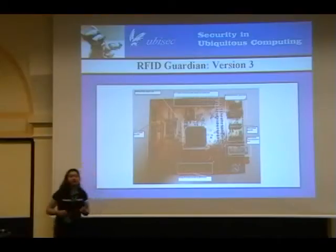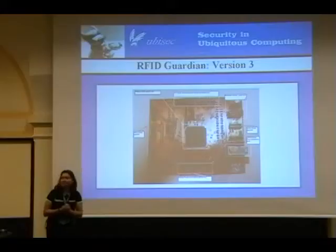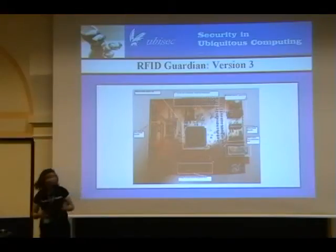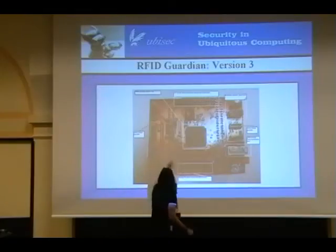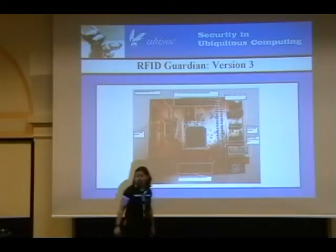There's also a lot of RFID at 2.45 gigahertz. Some of you are familiar with RFID in containers and pallets where you really need longer range RFID. Active RFID tags — the kind with batteries — also operate at UHF at 2.45 gigahertz, so we're working on building an analog front end for that. We also have pluggable bits for a TFT touchscreen — you can see there's a place at the top for that.